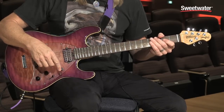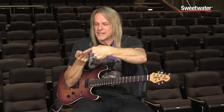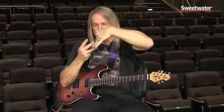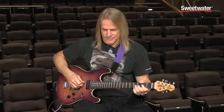In order to make this happen in this position with only a five-position switch, we had to use a multi-pole switch. Instead of one wiper going between the three pickups, there's a set of four of them all doing the same thing in parallel, so we could switch the wiring around. Bottom line: it's one switch instead of three — my four pickup guitar uses three. We ended up with a five-way switch because I discovered live I was using five sounds, five combinations of the switches. It simplifies things so you can just pick it up and everywhere you go there's a sound you can use.